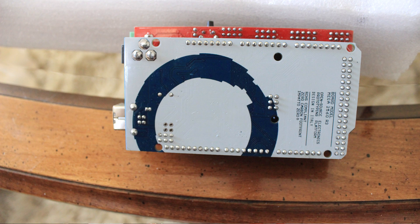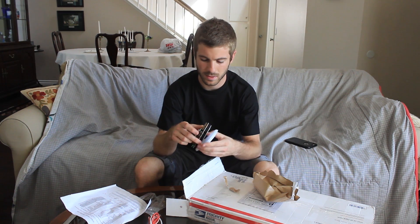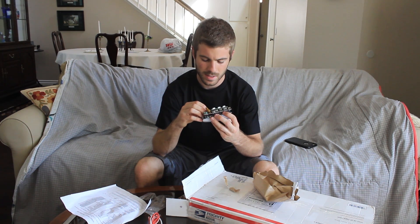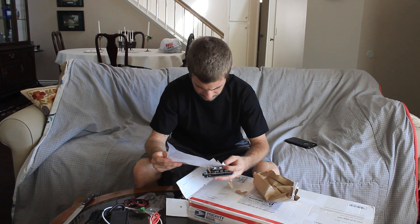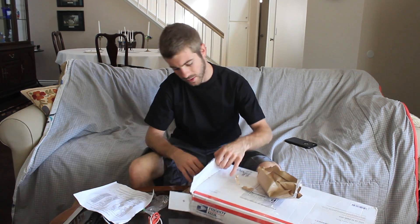We've got the electronics. So that was right — we've got the RAMPS 1.4 board with the Arduino already connected to each other. Also, all the drivers are already connected with the appropriate heat sinks, and he's got the jumpers in place under each driver, which is really nice. On my first build I didn't put the jumpers on and I made a lot of mistakes, so it's nice that the jumpers are already on there. I also wonder if he's fine-tuned the potentiometer on these driver boards. Regardless, the firmware was already pre-flashed on here, which is awesome — definitely one less step for people that just want to get their printer up and running as soon as possible.